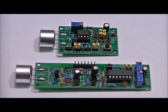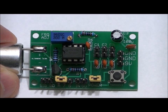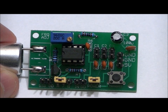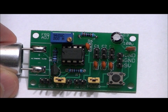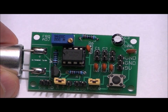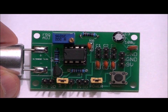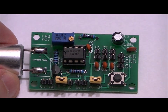Let's talk about the transmitter. To the right we've got our power supply 3-pin header — 9 volts and two ground connections. We've got three 100 nF ceramic capacitors, and above them we've got two-pin jumpers. Adding jumpers to these adds them to the oscillator equation — one shorted gives a faster frequency, and all three shorted gives a relatively low frequency. To calibrate to 40 kHz, you'll need to short two of the three capacitors. Any two will work.